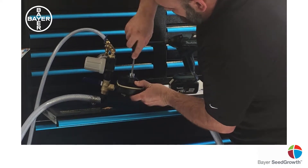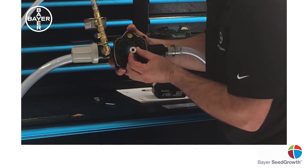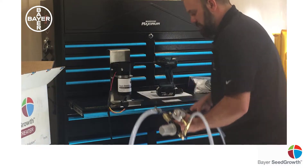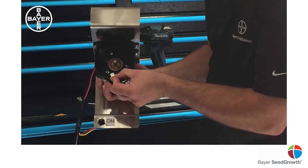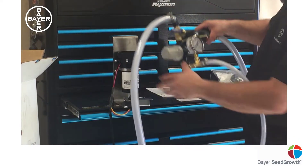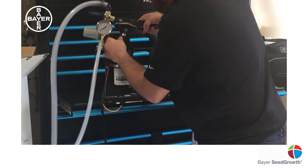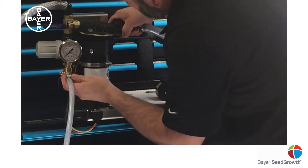You'll feel it snug up. Now if you look in here you'll see a flat spot on the shaft — it's hard to see but that's what you need to line up. This white part here kind of only goes one way — it lines up in that orientation so it can push that red button. Make sure it's sitting correctly. If it's not lined up it won't go on and you'll know something's not right. Slowly spin it to try to line up the flat spot of the shaft — it takes a little finessing. You'll see it, and then it pops on.